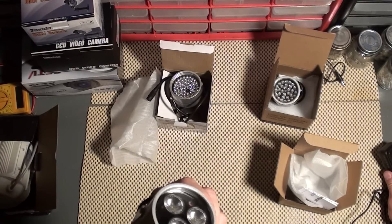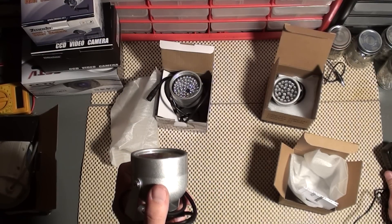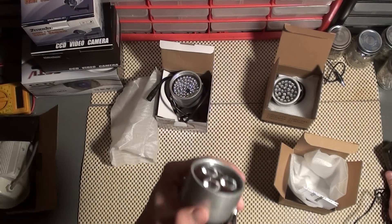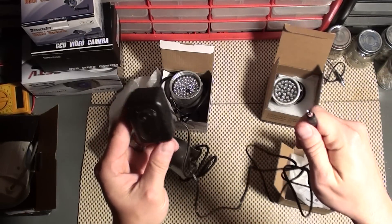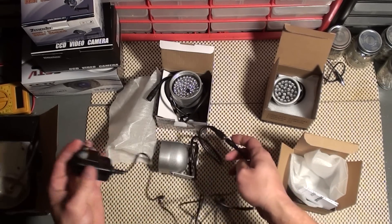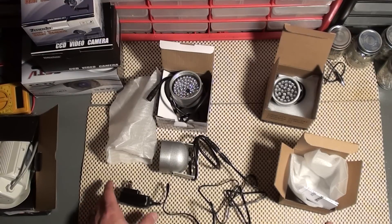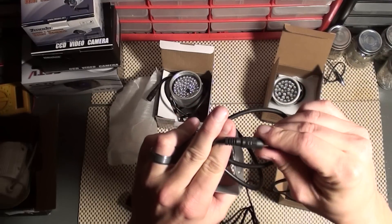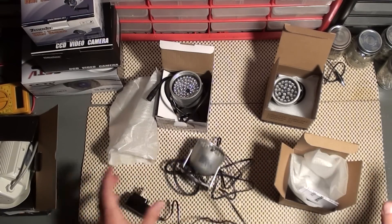You can also mount these in a different place — like with the pan-tilt camera we're testing, which is high up at the corner of the house — and place the IR illuminator lower so it casts a brighter range onto the scene. You can also get standalone power supplies off Amazon for around six to eight bucks, and those plug right in. The most convenient option is definitely to not run more wires and just split off your existing power cable. Always weatherize your connections with electrical tape or similar to ensure weatherproof connections so you don't get moisture shorts.